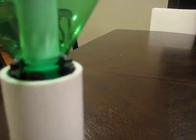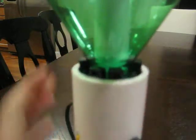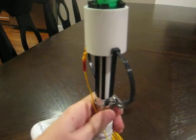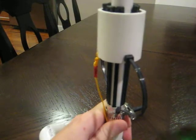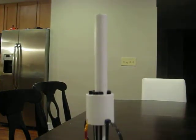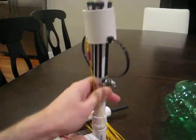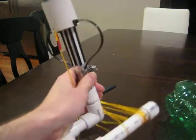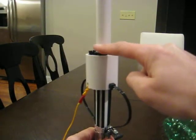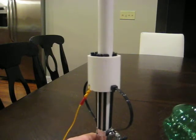To adjust that, push the bottle down as tight as it needs to be, then loosen the hose clamp — you don't have to loosen it all the way, just enough. That makes it so the entire assembly can move up or down. So if you have a bottle that likes to clamp right up high, you can raise the assembly up and tighten it. If you have a bottle that wants to clamp way down low, you can bring it down and clamp it there.